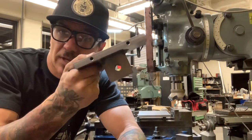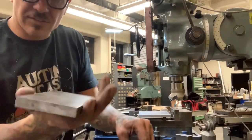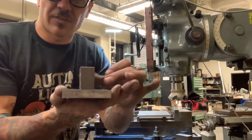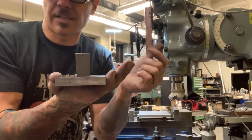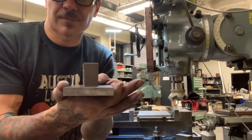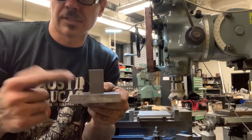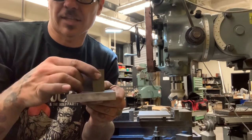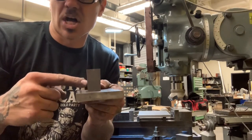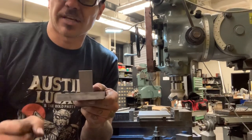The old style die plate had a pin. The new style die plate is more like this — it basically has just a plate, and then you need your tenon. The tenon has to have an angle cut on it, and that's the tricky part. The set screw goes into that angled surface, and because it's at an angle it won't slip out — that's what makes it brilliant. If you did it flat, it'll just mar up and gall, so you want the angle to lock it in place and keep everything solid.